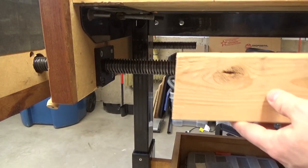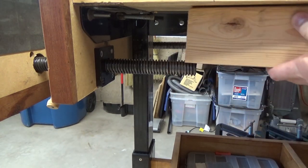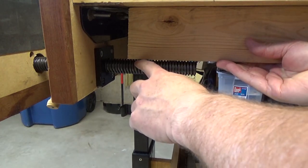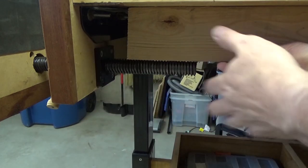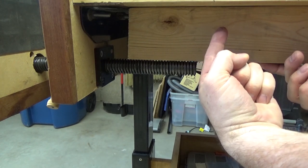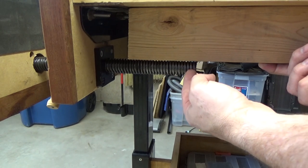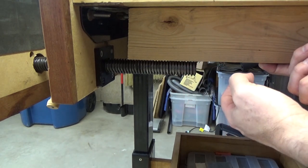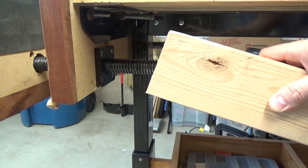The only other step in the instructions that I didn't follow was to add a support block between the back of the screw and the bench. The suggestion is to put a block that rubs against the screw so that as the vise is advanced and the weight puts downward pressure, the wear block will counteract that gravity-induced racking by giving the screw something to ride on. So far I've found that I haven't really needed that, mainly because I don't open the jaw that wide, but if it becomes a problem I can always add something later.